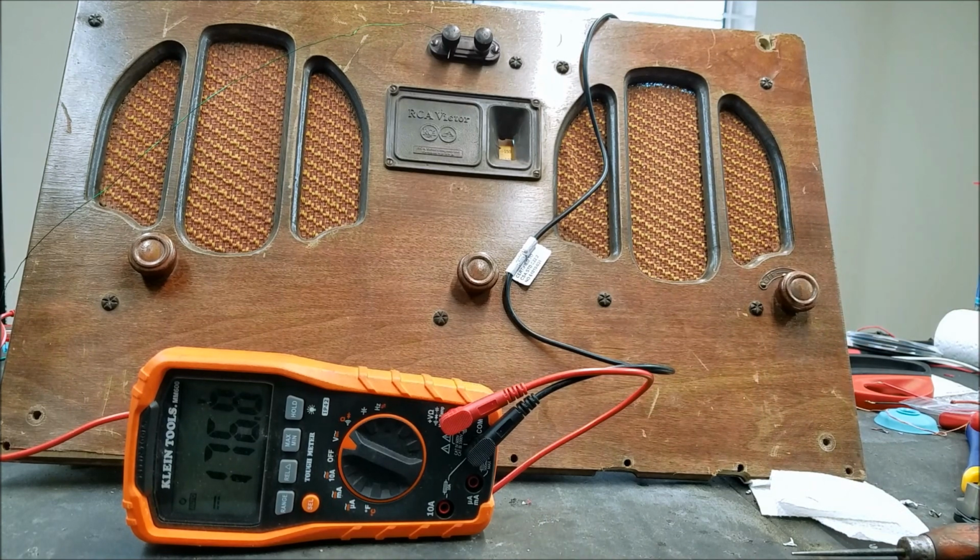Okay, we don't play too much before I get a copyright strike. So this sounds pretty good to me. I might play around with the batteries a little bit more just to see if I can get closer to the 180 we're supposed to have. But the radio seems to be working fine on the 150, or whatever it dropped down to. I think it dropped down to close to almost 140. The radio seemed fine to operate there, so maybe I'll play around with the batteries a little bit more. But overall, I think this is going to be functional for now.